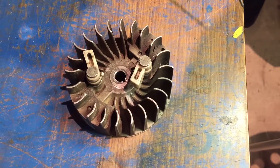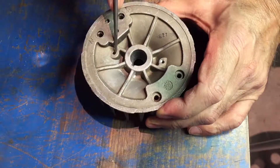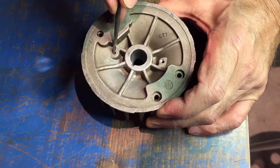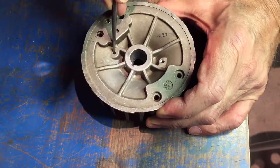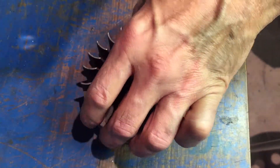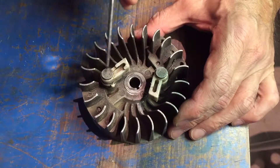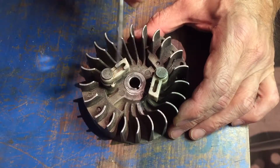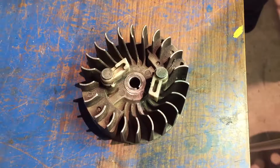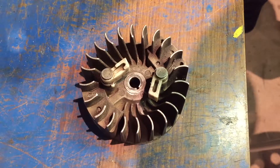The way to overcome this is to drill two holes through the back where the studs are, then press them out, tap threads in from the front side, and put in low profile cap screws. I'll demonstrate this process once I've pressed out the studs.